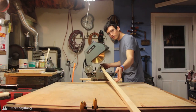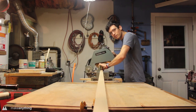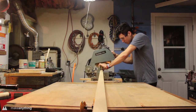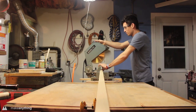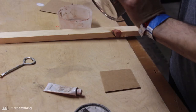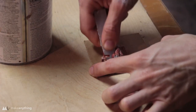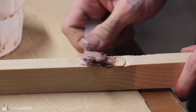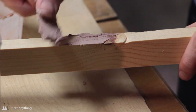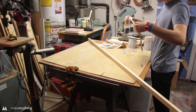So that's what I'm sharing today — the light stick, the light wall, whatever you want to call it. I started with this long piece of oak wood I had lying around; it was pretty much the perfect size, I just needed to cut it a little shorter. My first thought was to use a PVC pipe, but PVC is awful for the environment and it would be too flexible, so wood was a really good choice. There were some knots I wanted to fill in, so I used some Bondo, mixed that together, and filled up any gaps.